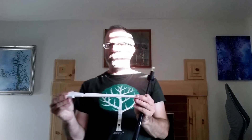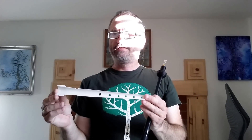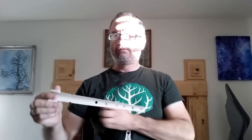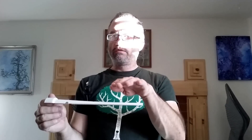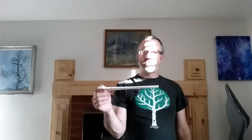I did try to print the Chanter out horizontally, and right in here it printed out like this. So at the top of the dome, which would have been right in here, you had some spaghettying effect occurring — basically there was nothing underneath. As the curve went to its peak, there wasn't any layering underneath that would work very well.